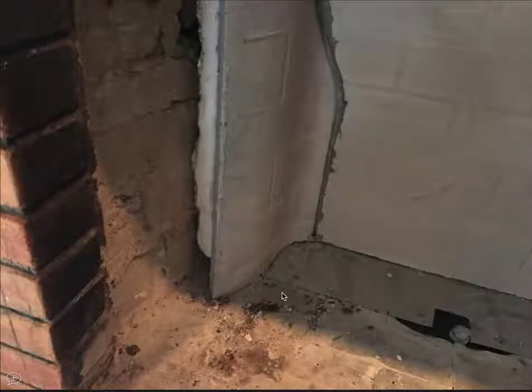These side panels and back wall have an inch ceramic wool blanket with a foil radiation shield behind them. Those go in place, and once in place behind this panel — this is our back wall as it slopes up — we can see our insulation here. The parge coat on the smoke chamber then gets blended in.